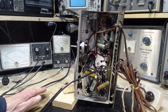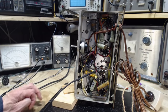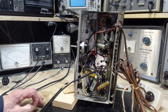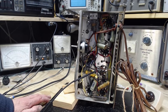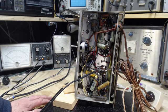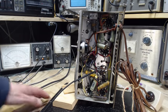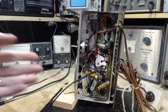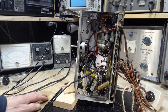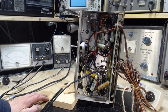What this will have done is cause the voltages on the tube heaters to not be correct. Exactly who the loser is hard to say offhand. It could be all of them are running a little low in voltage. Could be one in particular is running quite low. Well, I think what I just said is probably not very true. They're all getting the same current, 150 milliamps.